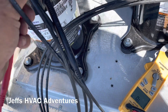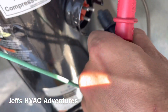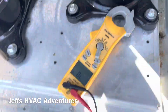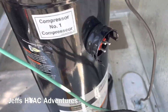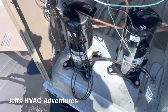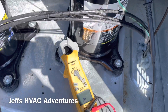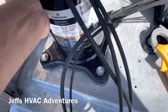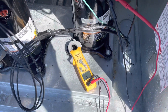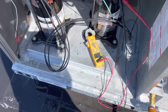We've got one of our compressors out of thermal overload — this guy is out. The other one is still in thermal. Let's work on getting this guy cooled down with a bucket of water. You've got to do what you've got to do sometimes to get your customer back up and running. Once we get the compressor back running, the natural flow of refrigerant through the compressor will help cool it down — we just got to get it there. I'm going to go grab another bucket of water and keep on pouring.